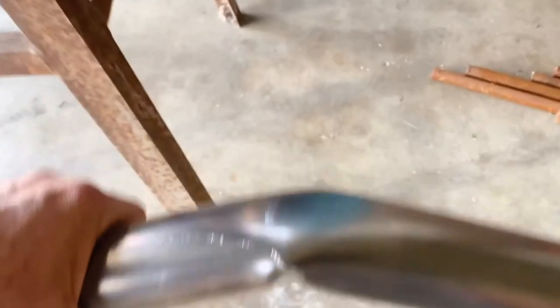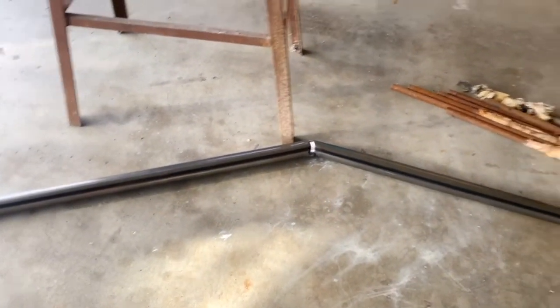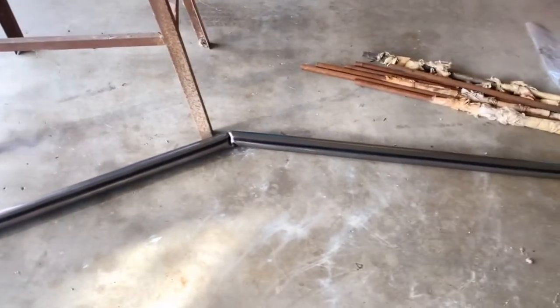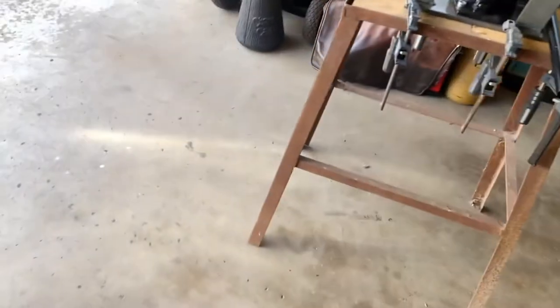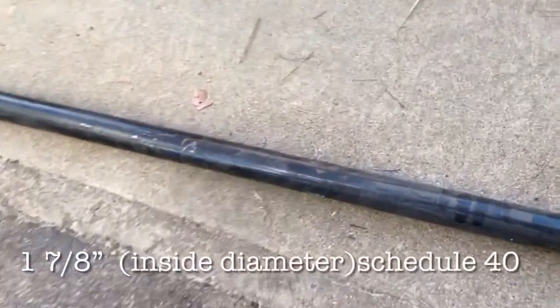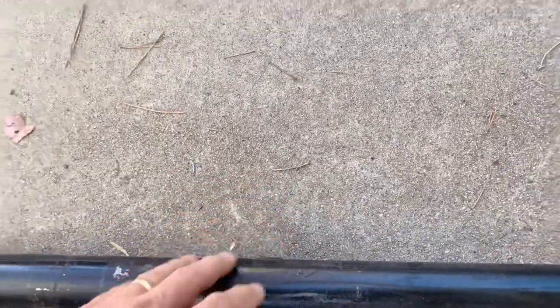Let me show you what happened. I first tried to bend it and that happened. I realized that just because some metal is thinner, that doesn't mean it's going to bend easier — it's actually not going to bend at all, it's just going to get crushed. So I moved on to the black 2-inch schedule 40 pipe, actual pipe.